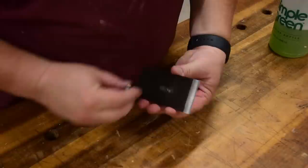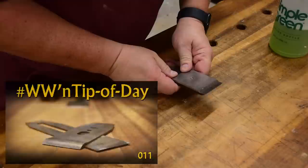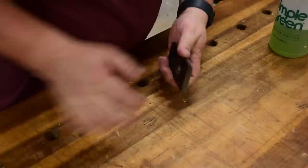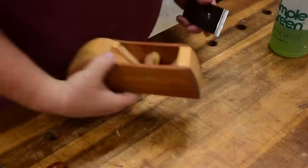Reassemble your chip breaker — there are lots of opinions on chip breakers, I've got a whole video on mine. I'll get it close but I'm not getting it fully to the edge. My thinking is we used solid blades for years, so really the chip breaker is just adding mass so it doesn't chatter as much. And there we go — blade's ready to rock and roll.